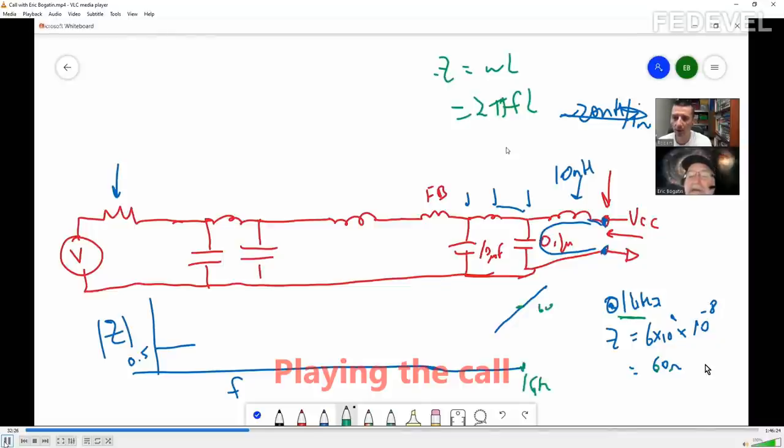And why are we looking only at this last inductor for the highest frequency? Oh, we're going to look at all of them, but we're going to work our way in from the outside edge: the lowest frequency I can do in my head, the highest frequency I can do in my head, and the in-betweens, that's where the resonances are. I'm not going to do a lot of work here, just roughly guess. Okay, why for the highest frequency have we not included everything, only the last loop?